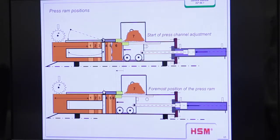In front of them you see the wheel. You see the single tooth on the wheel, and the part over the wheel is the proximity switch. When we have metal in front of the proximity switch, we get a signal. When the wheel turns on the material, one tooth and the other tooth each give one signal to the switch. Then we add 43 millimeters, 43 millimeters, and so on, and that way we measure the length of the bale. With this machine we make only 50 steps, but it's not 50 millimeters, because 50 means 43 millimeters. So when we choose 500, that's not exactly 500 millimeters. It's 10 steps, and exactly 430 millimeters.